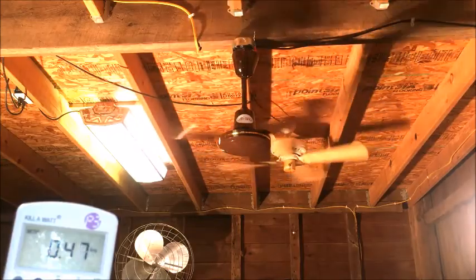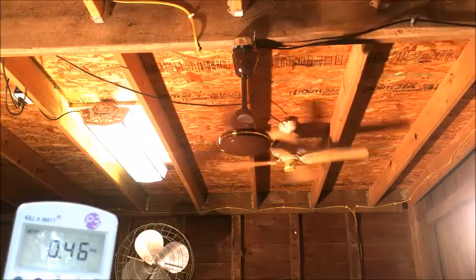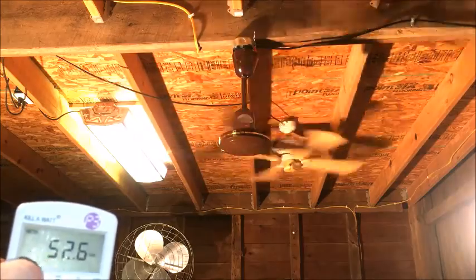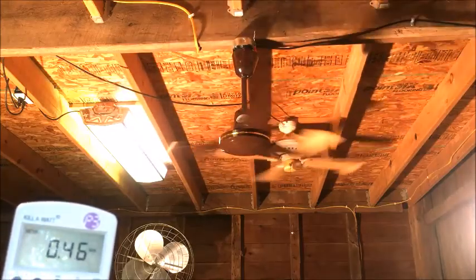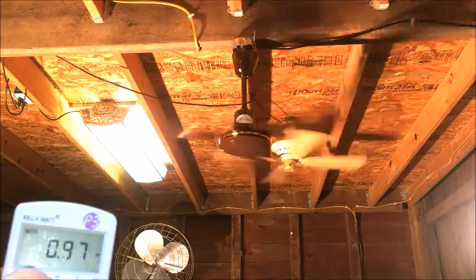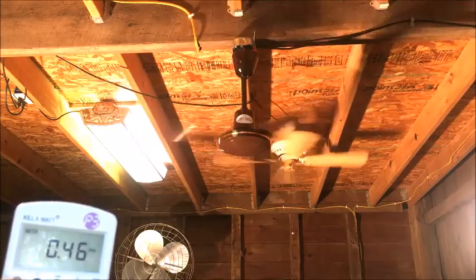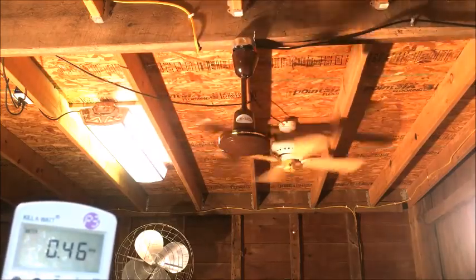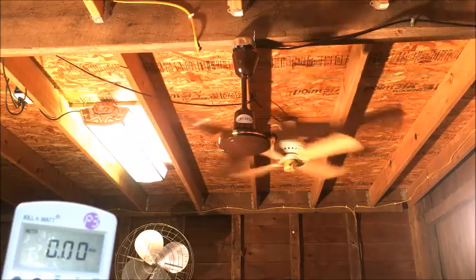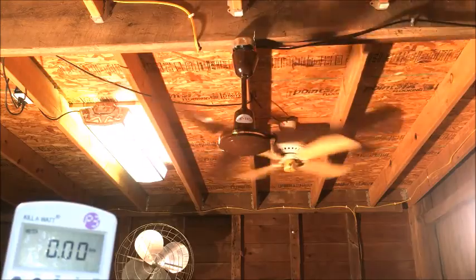Actually, go to where it stops. Can I turn it off? It's going to drop a little bit. Let me see what it drops to. Yep, it's dropping to 0.46. Let me just see what the power factor is. Yeah, it's a power factor of 1 with 52 watts. Let me compare it to straight high for a second. I want to see the power factor. I forgot to test that. It's about 52 or 53 watts, we'll call it. Okay, it's off now. We did 0 to high already, and decade and solid state. That's actually everything for this fan too.